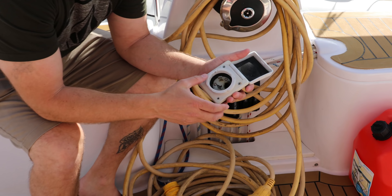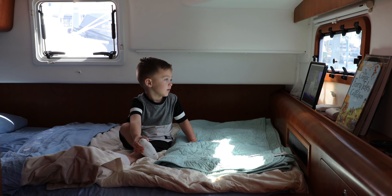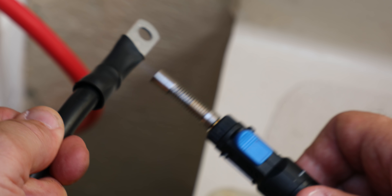So this is what it was plugged into. Basically we replaced the receptacle. Welcome aboard. He got the water maker running, but there was a little leak underneath the membrane. So we had to remove the membrane, which involves some Wiggins fittings and stuff like that. Took them off, tightened that one down, and now we're putting it back together. Run it again and see if it leaks. I'm sure it will be wonderful. Should be good.